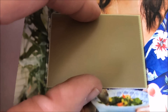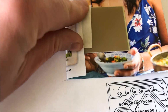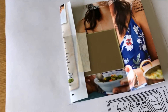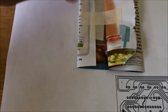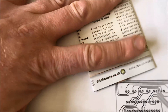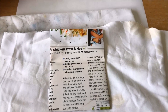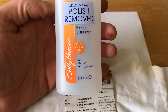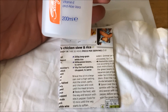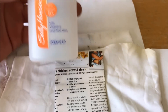This board's a bit smaller than what I need, but it's just an off-cut I've got for this video. I'm just using masking tape. To transfer the image onto the copper board I'm using nail varnish remover, or nail polish remover. It works absolutely fine. I used to use it on the silk screen layer and decided to give it a go on the copper board layer. It saves all the time of ironing and heat transfer, and it works.